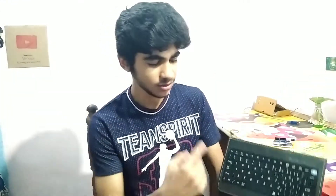The logic is simple. When we play computer games we usually press the WASD keys. So what we have to do is: when we press the push button, we just need to send these letters to the computer as input. We're not just printing — we're actually giving input to the computer. So we can use the keyboard.h library from the Arduino IDE.